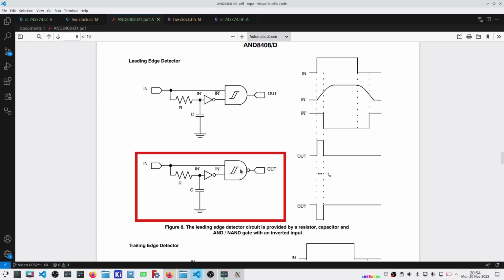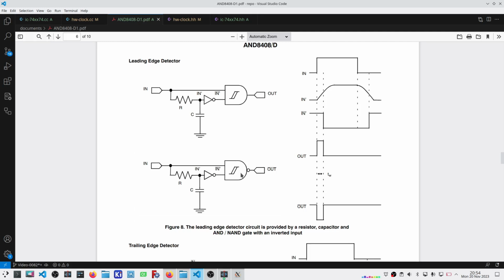And this is the circuit that should allow me to do this. Now they've got a Schmitt trigger NAND gate, and I'm not certain I need the Schmitt trigger, certainly not on what's coming off of the signal. So I should not have a problem with bouncing where I actually need to worry about the behavior of the Schmitt trigger. So what do I need to do?